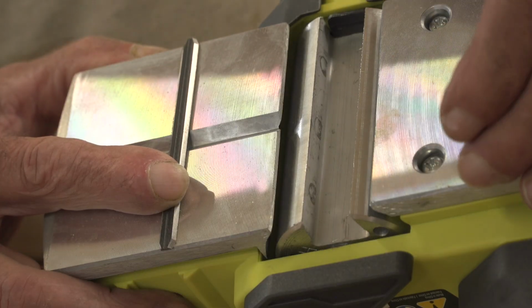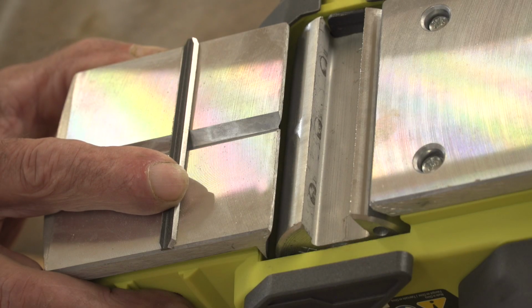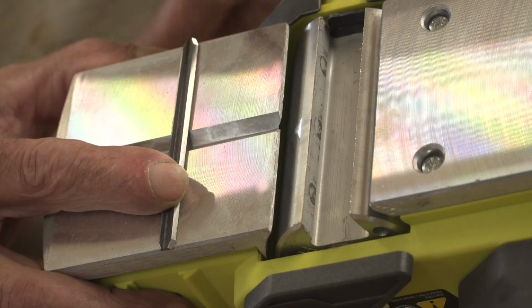And when you tip the planer a little tiny bit, it cuts this nasty groove in what you're doing. No good, you can't do it. You have to shorten the blades up. You can either grind them right off square at the end and shorten them up that way. I just taper them off like a little 30-degree angle like that, and it works just perfectly fine.